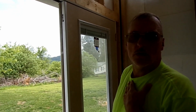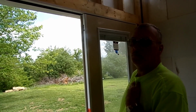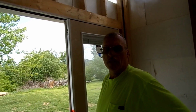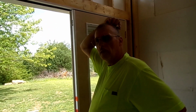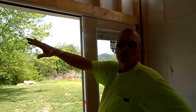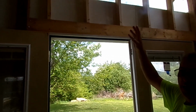Guys, today I'm going to do a little catch up. We've started in on our inside framing. Up to this point it's kind of been confusing, with fiberglass panels on the outside, because we're actually working in reverse. With a normal house, you frame everything up, then start with your outside wall, then insulation, then your inside, whatever you want to put, sheetrock or wood. In this way, now we start the inside framing.